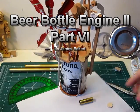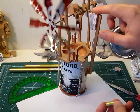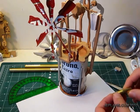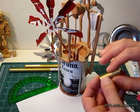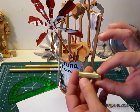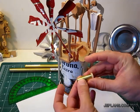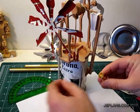I am working on a piston to replace the bellow on the engine. The bellow worked fine, but I would like to see how a piston performs in the same configuration. This new design will be a very easy piston to build. Basically it will be two nested tubes with end caps attached with a little epoxy. I will also need to re-design the air channel because the piston will need more space.